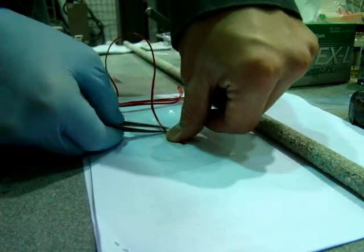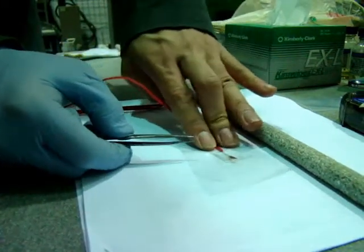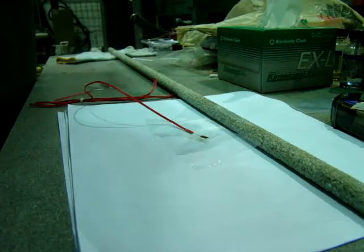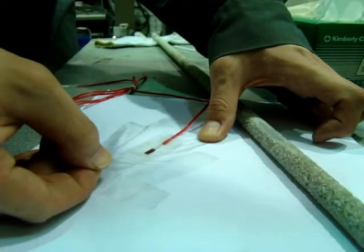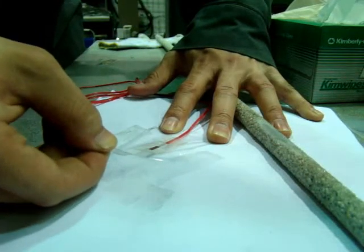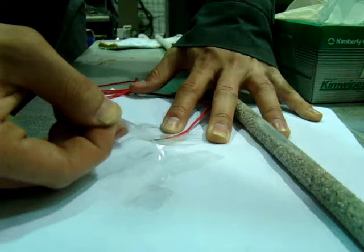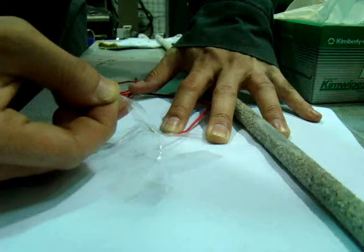Then apply a scotch tape on it and make sure to put the strain gauge in the center of the scotch tape. Carefully lift the tape at a shallow angle — less than 45 degrees — because the strain gauge shouldn't get bent too much. Remove the strain gauge and tape assembly and put it on the surface where it is going to be bonded.